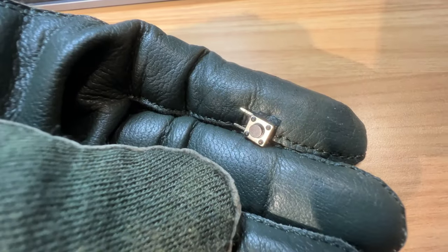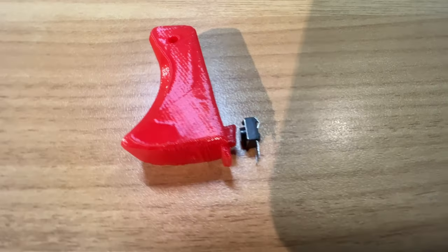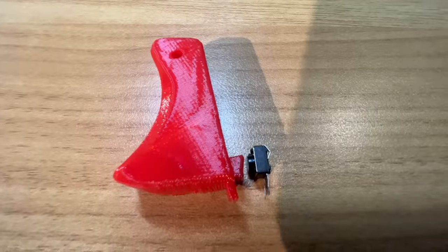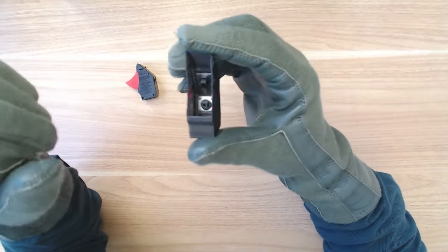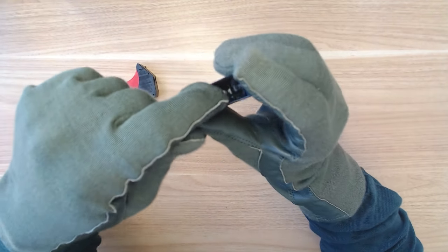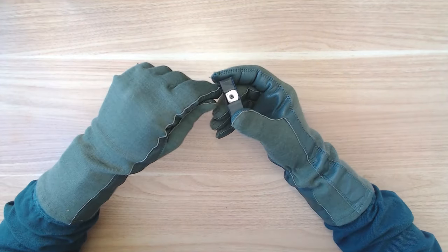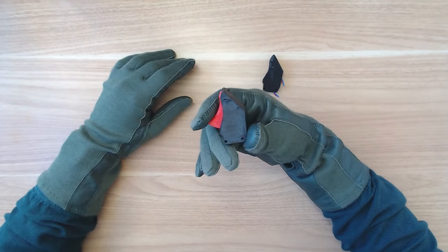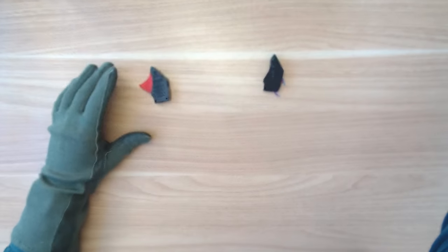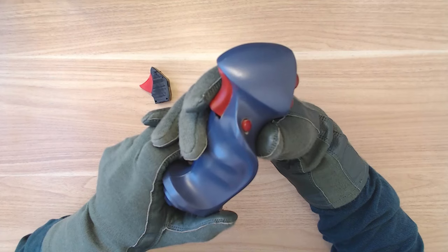Let's discuss the switches used in the triggers themselves. The most basic trigger simply depresses a tactile switch inside the grip. There's little to no travel, and the tactile feedback and force required to actuate depends entirely on the quality of the tactile switch. The benefits here are likely cost, simplicity, and rapidity, meaning you can pull this trigger likely as fast as you can click a mouse. If you ever played sims in the 90s like Mech Warriors and others, that wasn't a bad thing, and it's likely why these were so popular in grips like the Sidewinder and the Force Feedback 2.